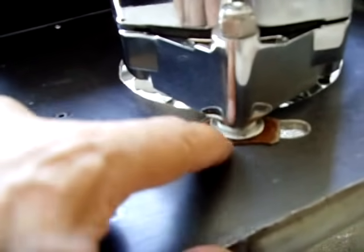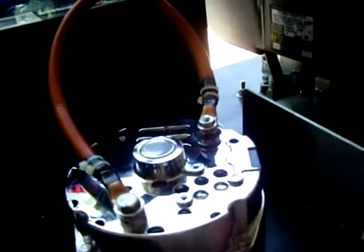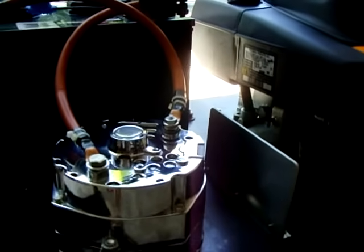The head gasket material has metal in the center but the outside is a very hard, non-conductive material. I put it on this side and also underneath, and that eliminated the problem. That's about it — I'll start it up and show you how it works.